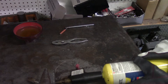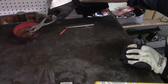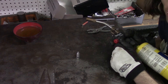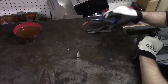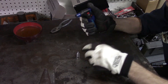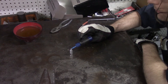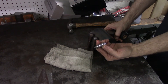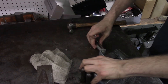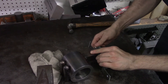It's reached the transformation stage, I believe. Let's quench this thing. What you didn't see me do in the last arbor support video was the tempering. The light blue color, when I was tempering it back then, was there for just a little while. I think we'll use butane instead — that ought to be slower. There it is: cooled off, tempered, and just polished up again. We can line up the two witness marks I made and put this thing back together.